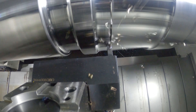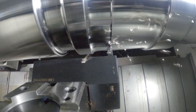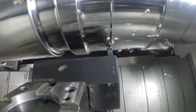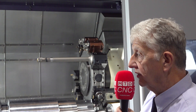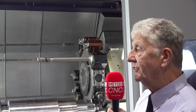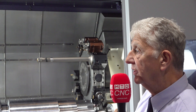Which is absolutely fantastic — that's a great story. But how does the machine achieve those large cutting forces and manage to resist them? How rigid is it? Well, every machine in this range uses box slideways. So it's a very strong headstock, strong slides, and it's that combination of factors which allows us to perform these very successful roughing and finishing turning processes.